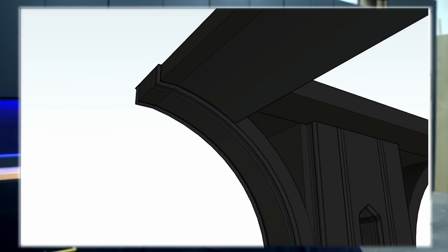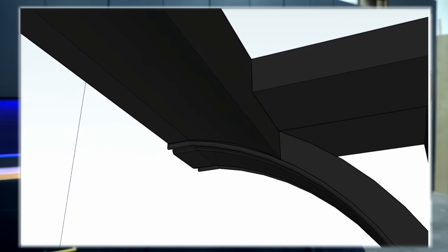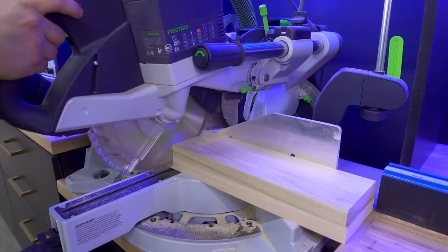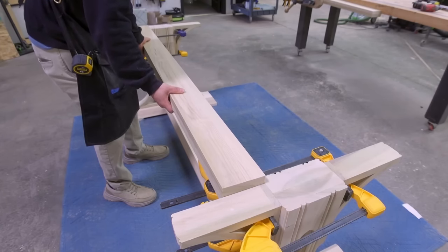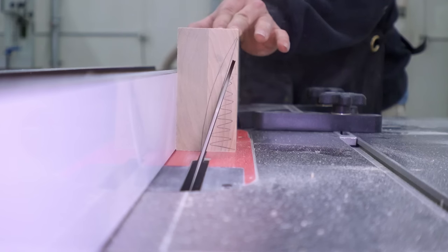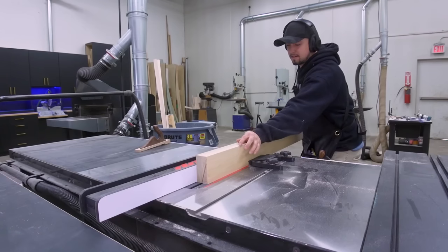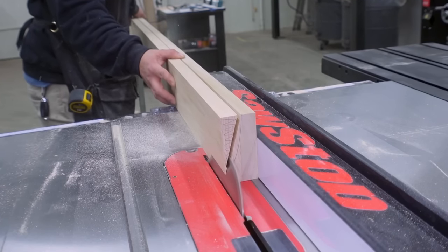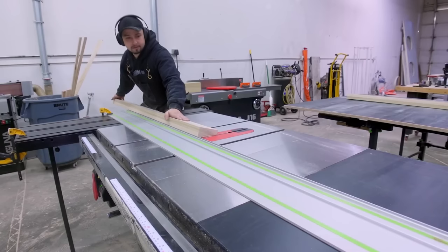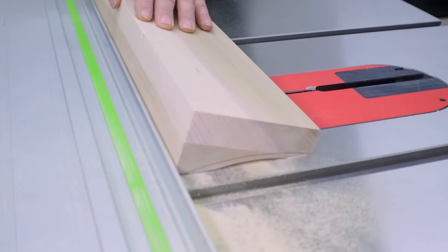The subframe meets up with the arches pretty intimately — so close, in fact, that it would probably look pretty shoddy if I did anything else than a nice matching arc to complement the marriage of these two pieces. Another way to get these arcs cut is running perpendicular to the table saw blade. I do this in multiple passes with the blade tilted slightly towards me, moving the auxiliary fence until I've cut to my line.